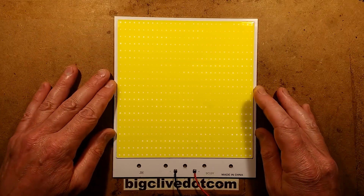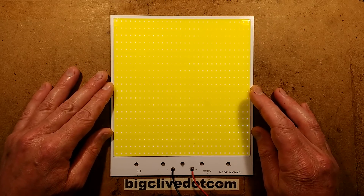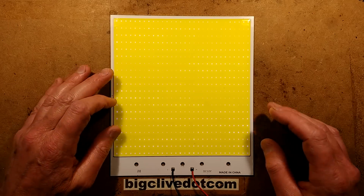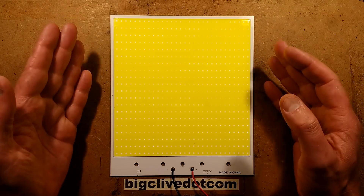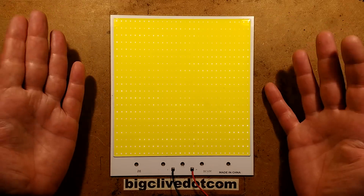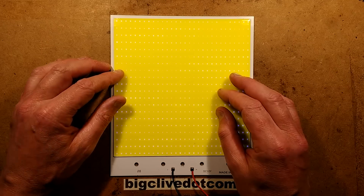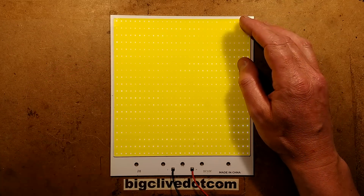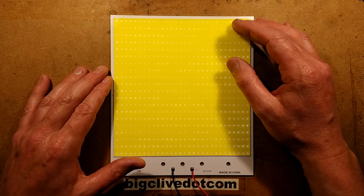But that's where it all suddenly stops being great. I wouldn't recommend rushing out to buy one of these quite yet, because these arrays tend to have a combination of series and parallel LEDs to make up the voltage, and there's no current limiting. They pretty much rely on the external wiring or a resistor for current limiting, and as such the LEDs should be fairly well matched — but these ones are not.